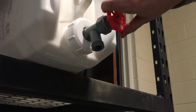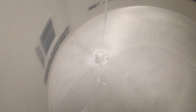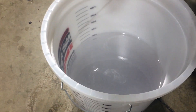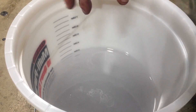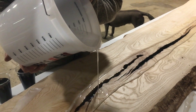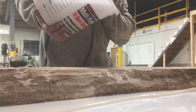Now onto liquid plastic. This is a casting resin and with proper heat dissipation, pours up to 3 inches thick can be achieved. The mixing ratio for liquid plastic is 2 parts resin to 1 part hardener — flip-flop those around and your resin will never cure. This product is specifically designed to cure over a long period of time at a lower temperature and has a pot life of 6 hours.